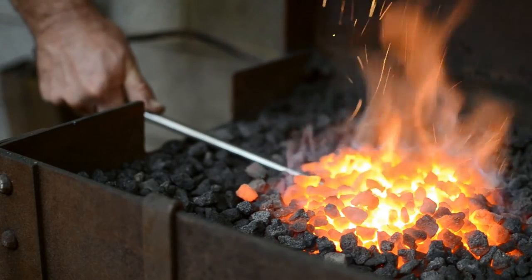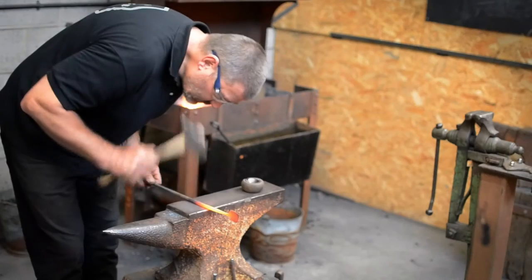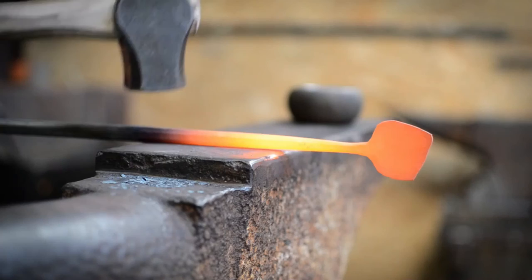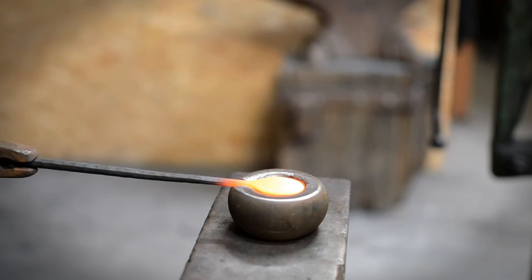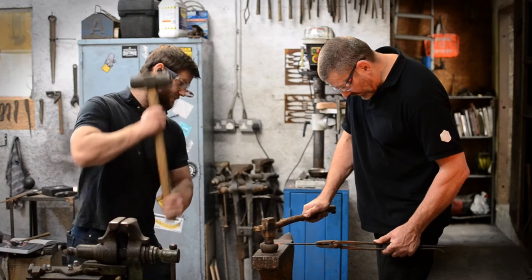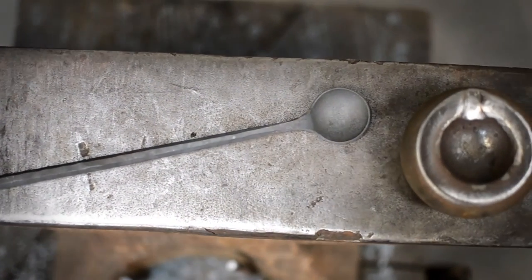Swaging is the altering of the dimensions and shape of material through the use of swages and dies. Swages come in pairs — top and bottom tools between which the hot steel is worked. Bottom swages fit into the hardy hole in the anvil, while top swages are struck with a sledgehammer by the striker. Alternatively, a smith can use a spring swage if they work alone. A swage set allows the smith to make an infinite number of shapes, the most common being tenons, which are formed at the end of bars for riveting sections together.